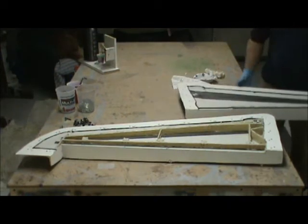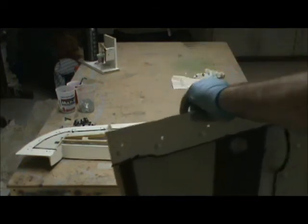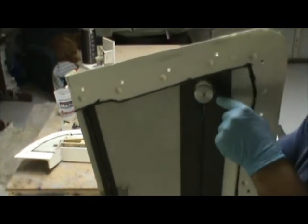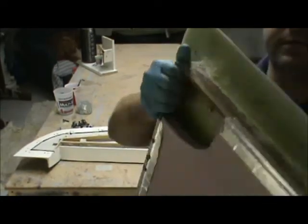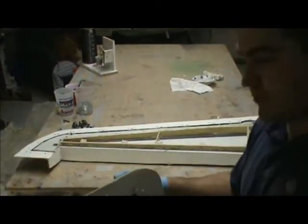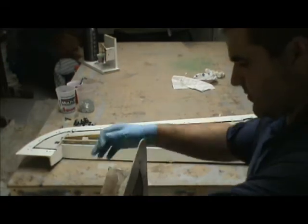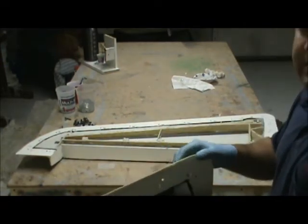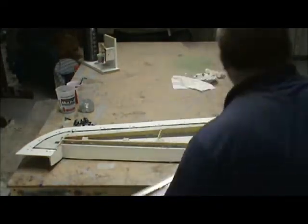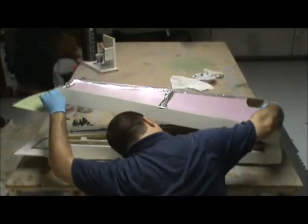You're probably wondering how that pivot point is going to be in the perfect position. You see the little aluminum disc here? There's a hole built into the mold and you can see the bolt sticking through — that's the exact position of the pivot point. This disc, and there's one on the other side too, will actually locate that pivot bearing holder exactly where you want it. Then there's a cutout in the wing skin — I'll show you guys how I did that in a moment.